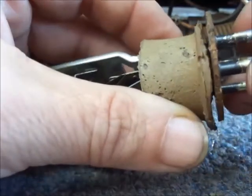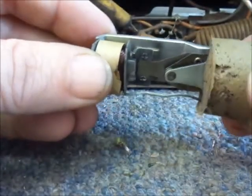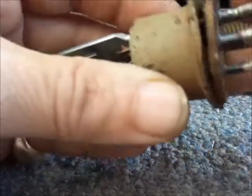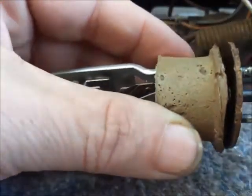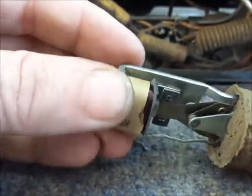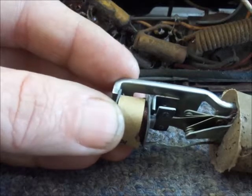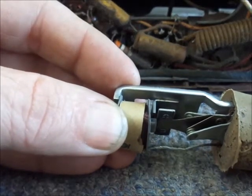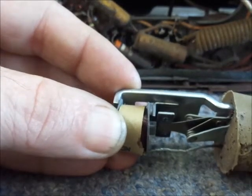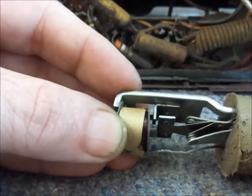It's got four pins on it. One is blank, one is ground, one is the 6-volt input, and the other is the output to the power supply. The large pin here is ground. I don't want to leave this connected very long, because I don't want to burn the surfaces of the points. And one of the others will give us our spark, the smaller of the two sets of pins. There we go. You can see the reed vibrating back and forth. The vibrator is working.